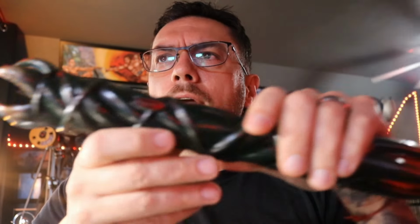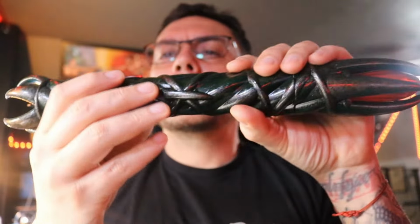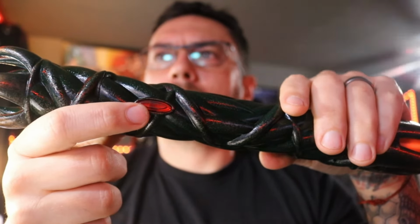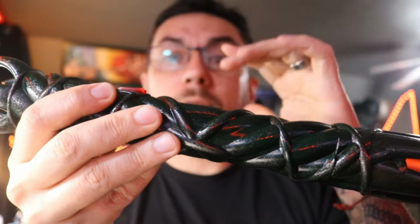We're going to go over the Red Mistress first because it is a bit of a unique setup and I want to spend some time talking about it. It's a one button setup, so your one switch is right here. I was able to get the pommel lit, although even though the switch is made out of the same material, because I have the tactile switch right underneath where this plunges, I wasn't able to get very good light out of this. So I went ahead and turned off those LEDs because they weren't doing anything.